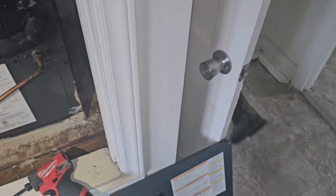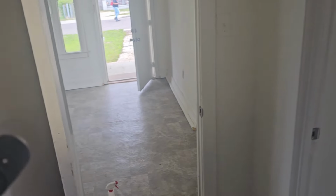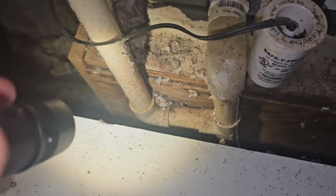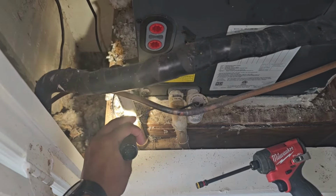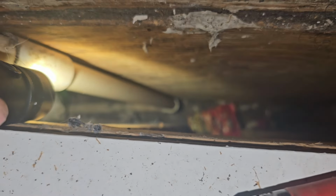It's already got a 90 facing down. You'll need a coupling, 3/4 coupling, and a 3/4 P-trap. They're in the black bin in the back. So we're gonna end up putting a P-trap on this. I thought this was a part of it, standing back, looking back here. I was like, okay, well, it would come this way. They made that as a vent, go down there, but they have a T-joint right there, 90s down there,